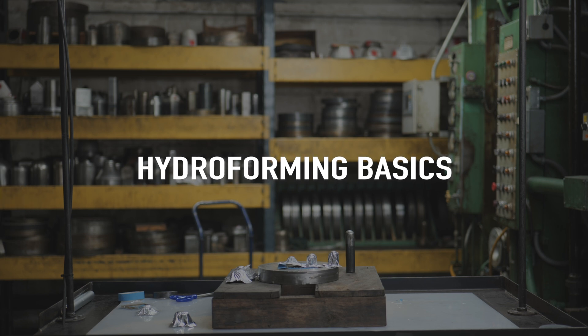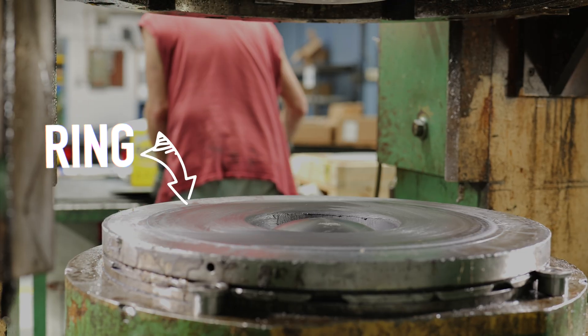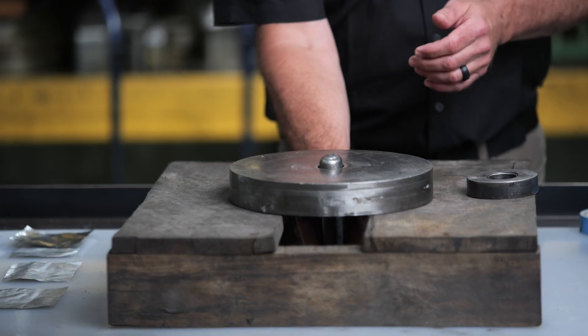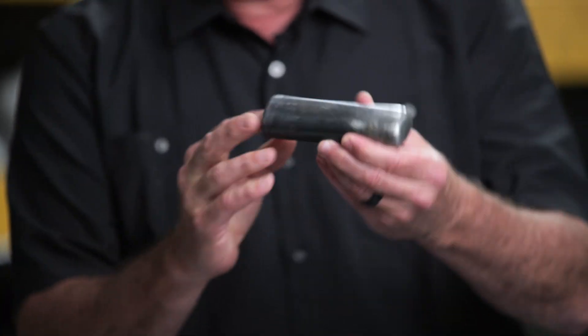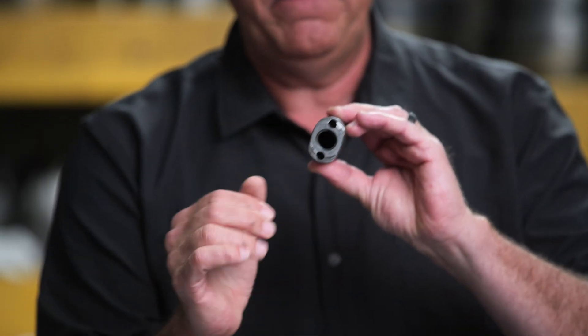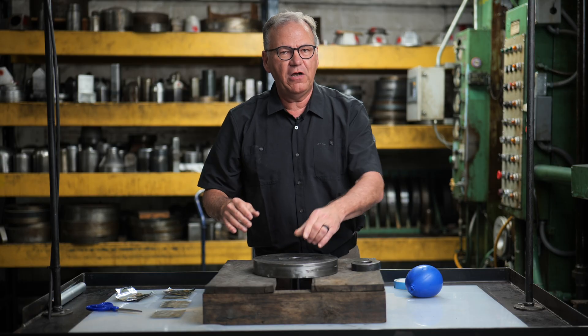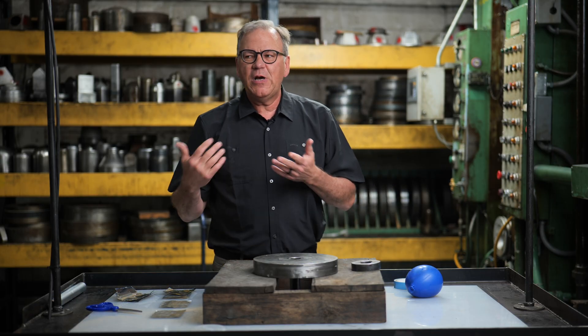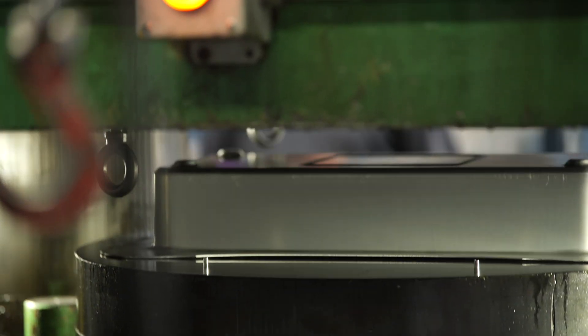I have some examples — in this case, a ring which would be mounted inside the press, and in this case, a punch. If you look at the punch, this is a typical punch; it's loaded inside the press with a thread. So we're going to simulate hydroforming and also try to make sense of why hydroforming is a good technology for you.